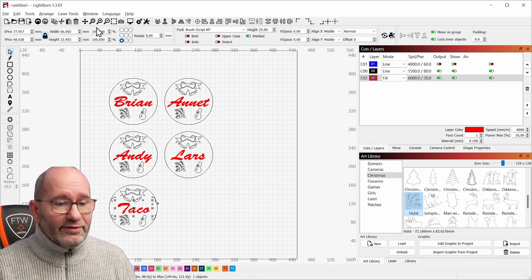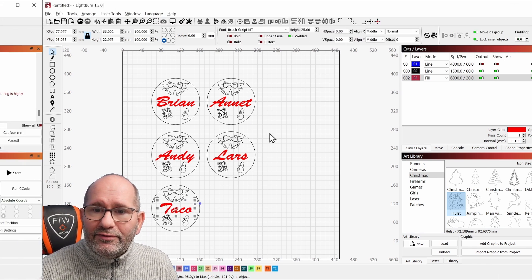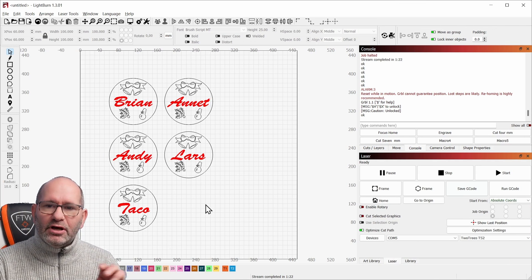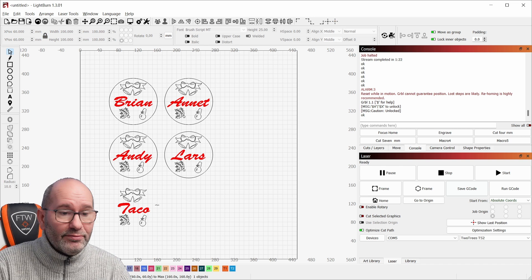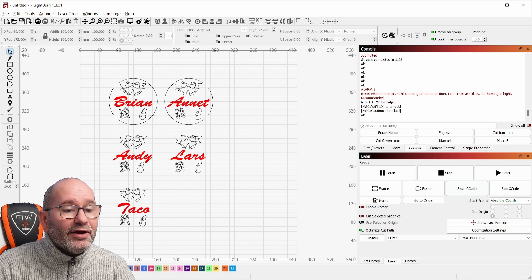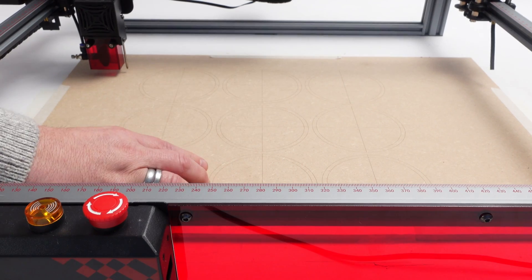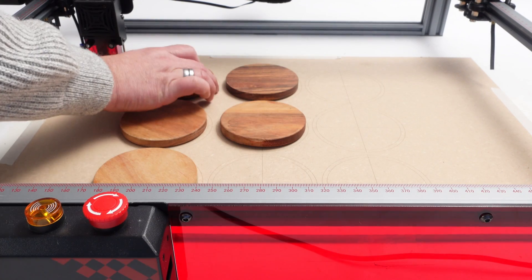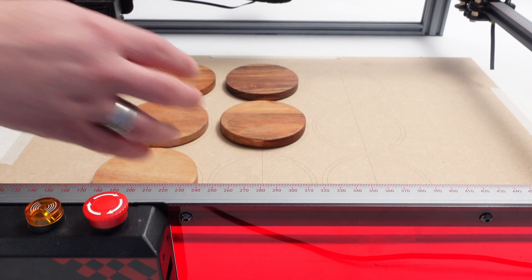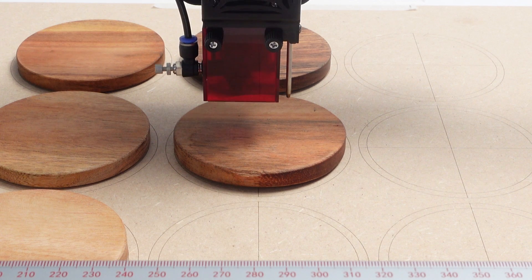I'm going to center to the whole bed. Now I can start the engraving. But I'm making a stupid mistake — I used those big circles to align everything but I don't want to print them, so I'm going to remove them. After removing them, that's when we start the engraving job, otherwise these will be engraved as well. Of course, first we have to place the coasters on the machine and lift the laser a little bit to bring it into focus. I'm working with a laser that can do autofocus automatically, but if you have manual focus, focus it on the top of your coasters.